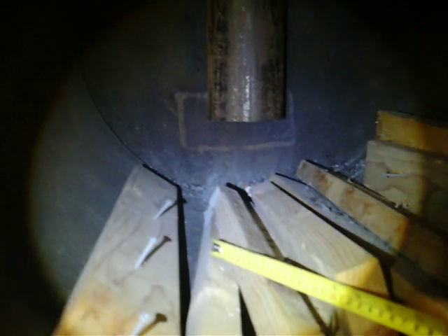Inside here it'll take a 32-inch log without any problem, all the way to the stack. This tank sits down a little bit — it's about an inch off the bottom. This is a 120-gallon propane tank, a quarter-inch wall. That's a six-inch by quarter-inch-wall, 55-inch-long pipe in the back, sitting about an inch off the bottom. The idea is to force smoke to keep its heat up in here. Since it's forced air it'll go out that hole regardless — a lot of times when they're cut off close to the top you lose a lot of heat. There's a little concern about plugging but if I have any issues I can cut it off a bit; just have to keep it clear.